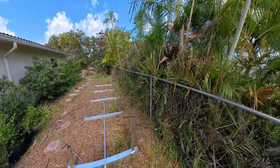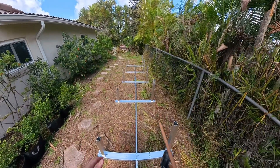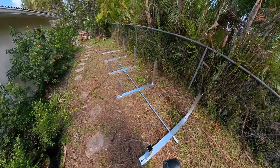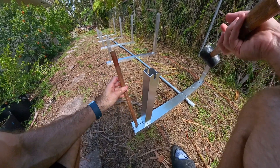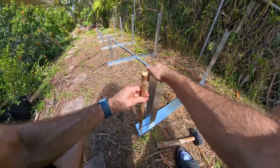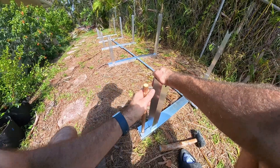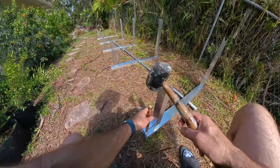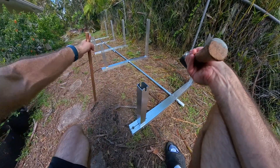It's now day two. We had a big rain shower in the afternoon so I waited until this morning to continue. I put a string line here to follow the line of the fence. The IR-15 frames are assembled with the conduit in the middle, and the next step is installing the spike anchors. I need to mark where the holes are going to be before pre-drilling, so I'm using a half-inch dowel fed through the half-inch opening in the frame to punch a mark in the ground.